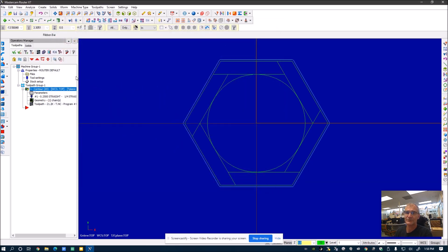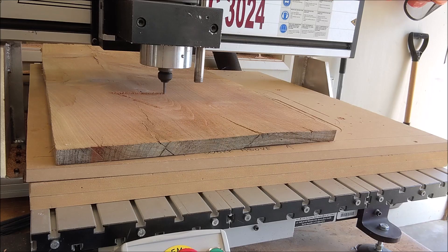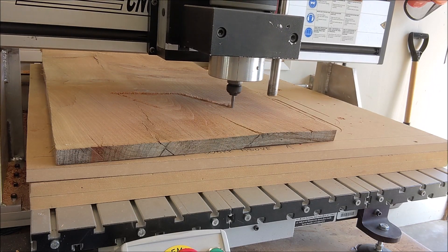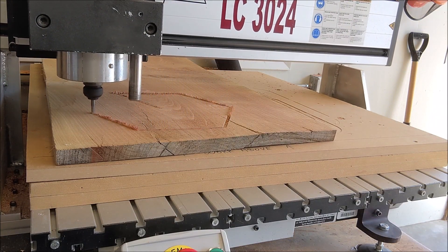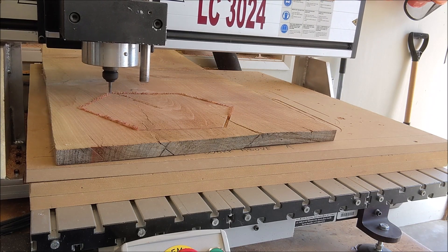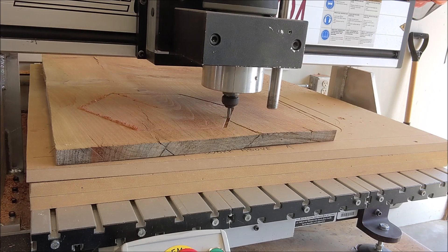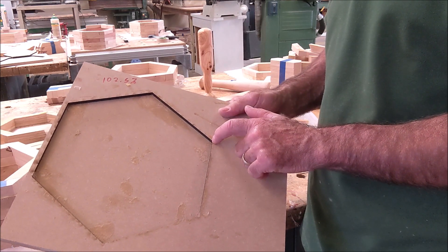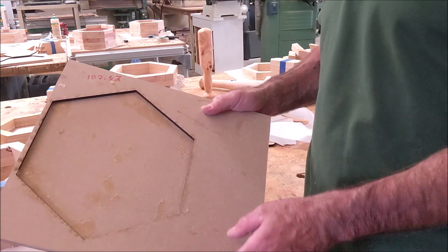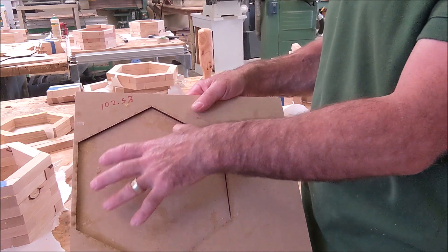I'm also going to run it on the laser cutter as well. I will put a link in the description so you can get the template, and you could just take that paper template and tape it to a board and cut it out. This is it running on a hand-milled cedar board with a quarter-inch flat end mill on the CNC router — just to give you an idea of how the CNC cuts perfectly symmetrical templates. You can see I dragged the bit a little in my programming and kind of screwed it up with that one drag mark in the center. Here's a laser-cut one instead. Again, I'll put this template in the description. You could print it out, tape it onto a board and cut it out with a jigsaw, scroll saw, or anything. This is actually 102.5% of the original shape, so it's just a tiny bit bigger so it'll fit in there nicely.